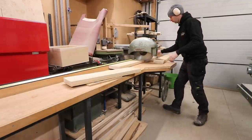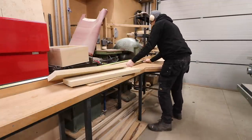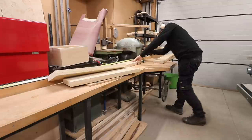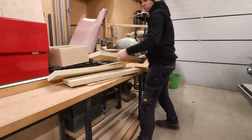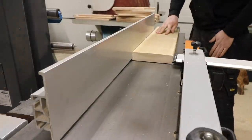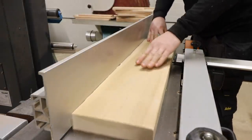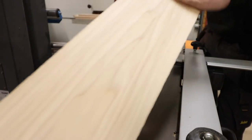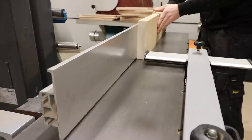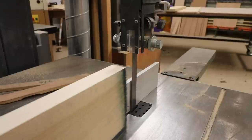Much the same as part one, I'm going to take some poplar or tulip wood and rip it down into some thin strips and laminate them around the former that we made in the first video, and that's going to give me the rails and the stiles for the door. So I'm not going to spend too much time going over that process. It's a couple of clips of getting the timber out and then we'll cut straight to putting the veneers in the bag.